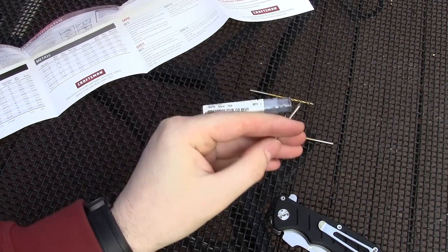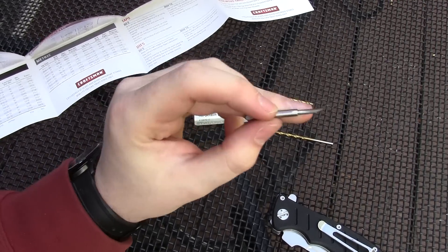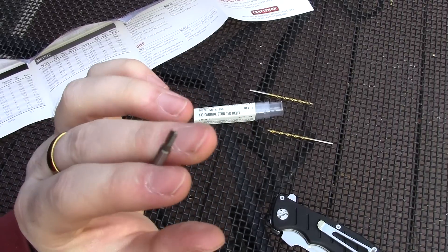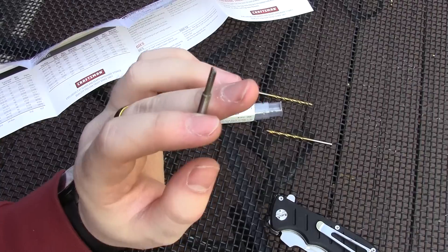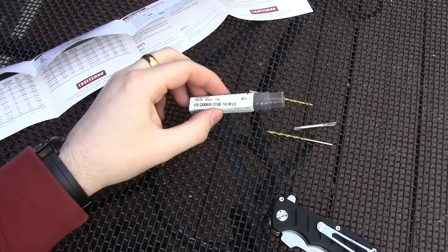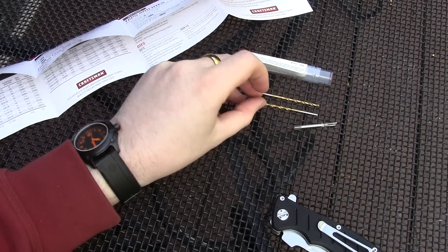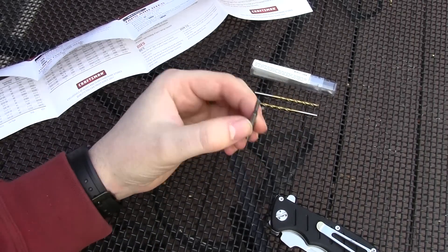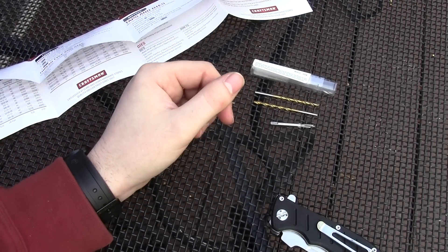It comes in, I use it, drill the holes, go to tap one of them, and pretty quickly break the tap. Here's one of the casualties of war. Fortunately, knowing that Murphy was working overtime on this project, I'd bought a second one as a backup. But at that point I had to figure out what went wrong — it had turned with so much difficulty, and I don't have much experience with these things. I just pushed it too far and snapped the tap, because they're made of very hard, very brittle steel.